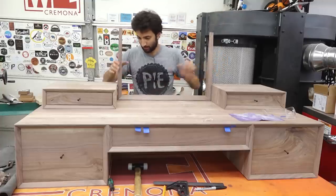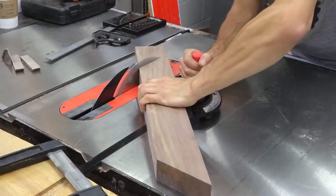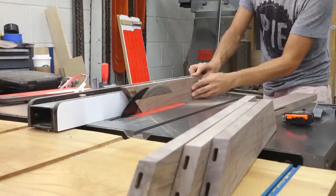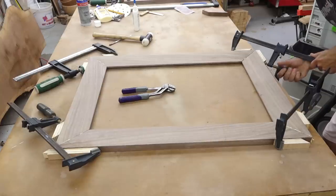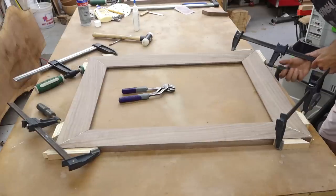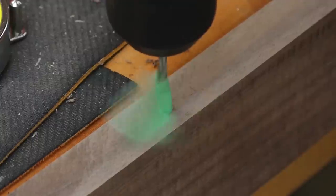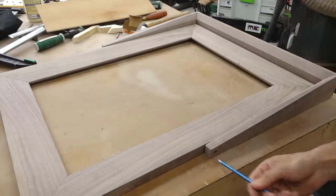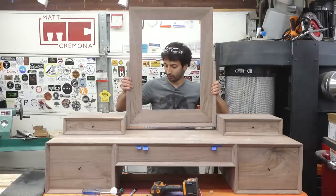And there's the stand. Next up is the mirror frame, and that just starts as a simple miter frame joined with dominoes. I added a large bevel to the front and cut a groove for the mirror in the back. I used glued-on cauls for the mirror glue-up so I can get good pressure along the full length of the miter. With the mirror glued up, I can attach it to the frame. I'll drill and tap a hole for a screw, and the tension of the screw can be adjusted so the mirror will sit at whatever angle the user moves it to.